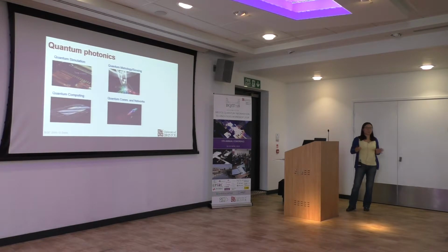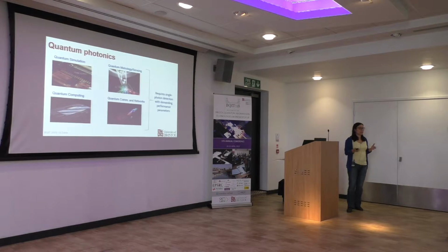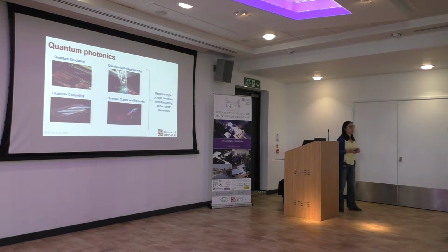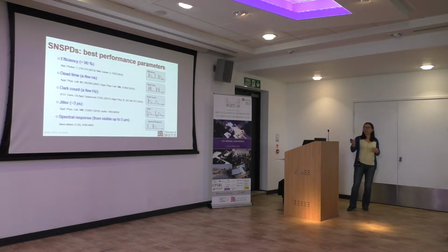So I don't know if there is a lot of need to motivate you for why we need single photon detectors. We have been talking about all the applications of quantum photonics from simulations to communication throughout the week. And all these things have very stringent requirements in terms of efficiency, jitter, and speed basically. Those requirements are not very easy to satisfy unless you have a detector which is an SNSPD. SNSPD stands for superconducting nanowire single photon detectors.